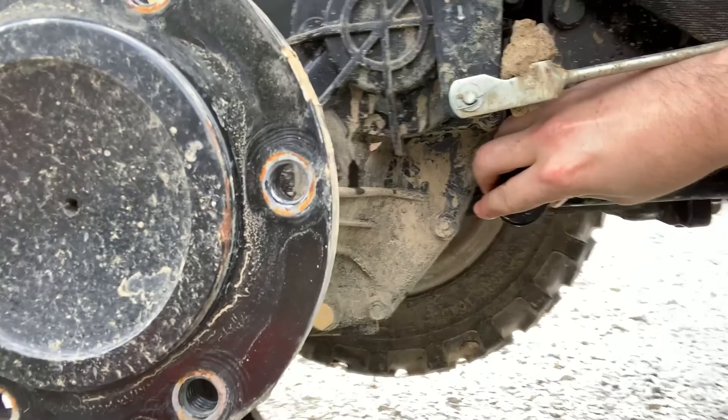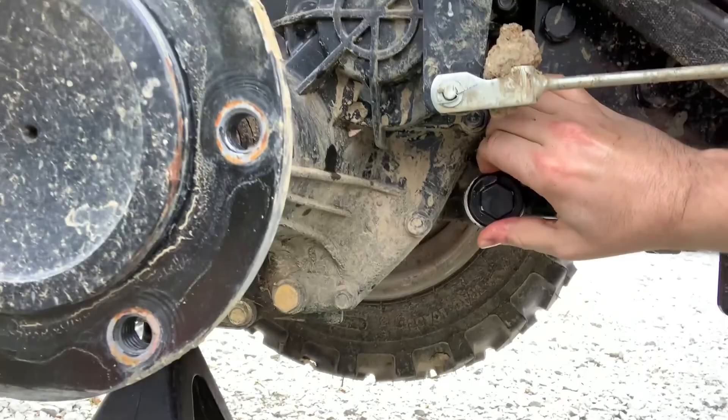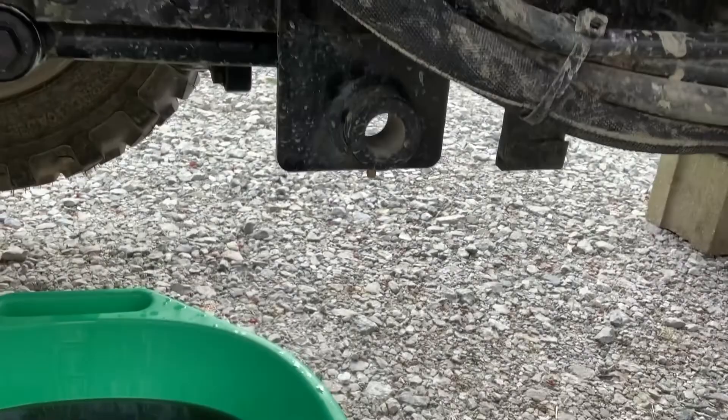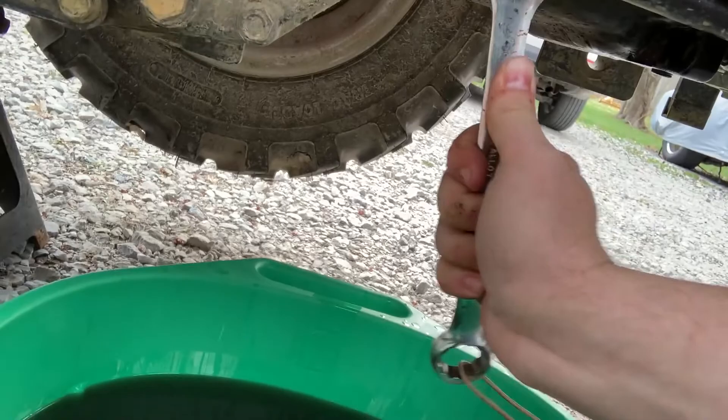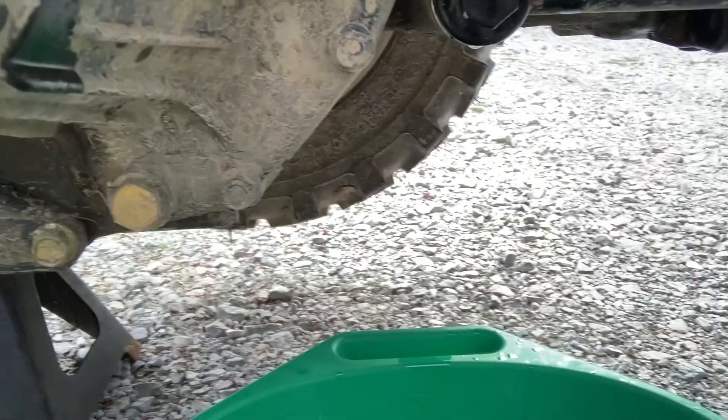As you can see, it's not the easiest to get it seated in here. Don't let yourself get frustrated and cross-thread it or screw it up. Be gentle, be easy. Hand-tighten it all the way around. Keep in mind it's going to be a little slippery from some of the hydraulic fluid. 23-millimeter wrench. Have patience with this stuff, guys. I know that's a dirty word when you're working on machines and cars. There it goes — nice and tight.